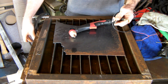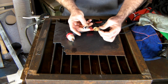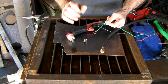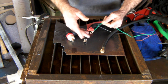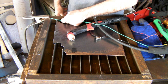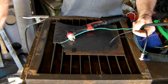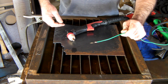With the pilot arc torch, instead of just having two connections going into your machine, there's a third connection — a green wire, sometimes red — that hooks onto a terminal on your pilot arc plasma machine. But if you haven't got a pilot arc machine, you're not going to have that terminal. So how do we get the pilot arc torch to run on a non-pilot arc machine? You could just hook the extra wire under your earth clamp, but that's a pain because the other plugs have to reach your machine too. So I made a special modified earth lead.